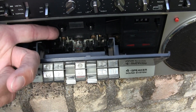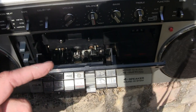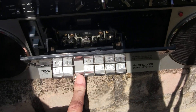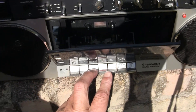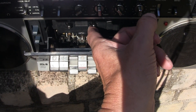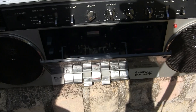Once again, if the tape gets to the end of playing reverse, it'll stop and do like that. But if only one is working like this, it'll stop. If you're going the other direction and the tape comes to the end, it'll stop. That's only if you have one tape button pressed. If you have them both pressed and it's on auto reverse, it'll drop, kick, and start the other side.